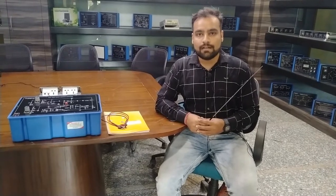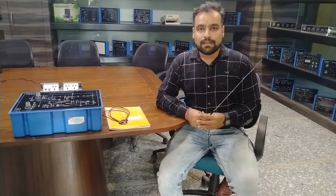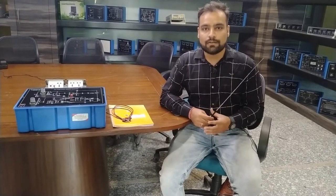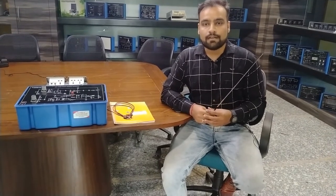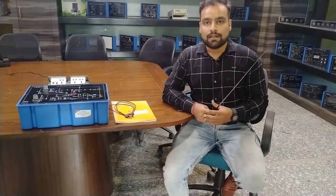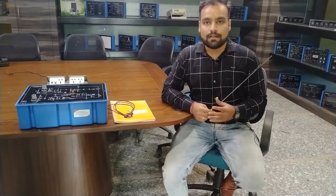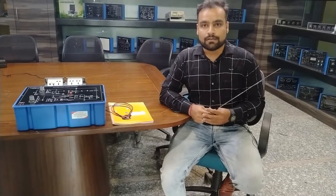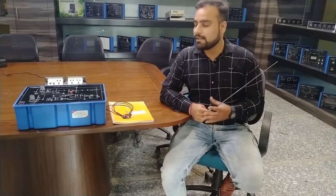We can vary the waveform output of the MOSFET chopper. A MOSFET is generally a very high frequency, low voltage control device which has a very low gate current. That's why it is very useful in chopper circuits compared to transistors. We are using a MOSFET and describing how it works as a step-down chopper.